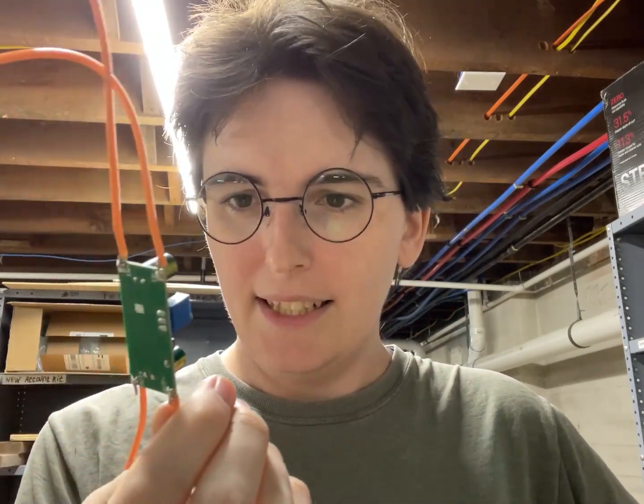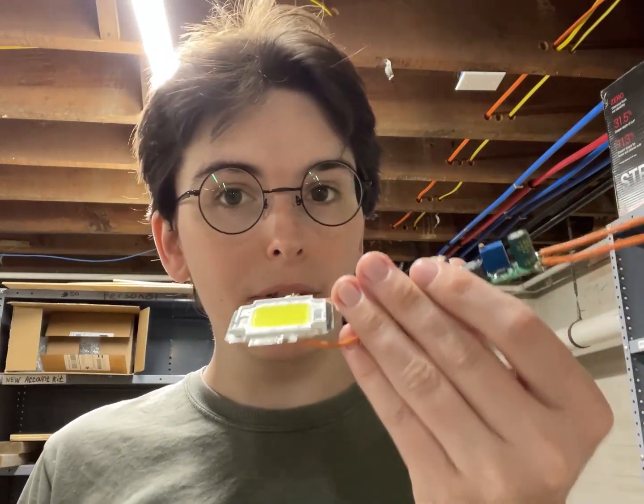Before I film this video, I have to figure out what went wrong. I'm glad I bought two converters. I'm thinking maybe that power supply isn't limited to 80 volts — it's only 80 volts under load. Maybe it puts like 160 volts through, causing a power cascade with about 80 volts coming out. Whatever happened, it was putting around 150 watts into this LED, which is way too much.